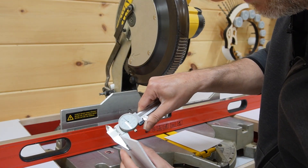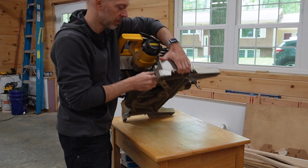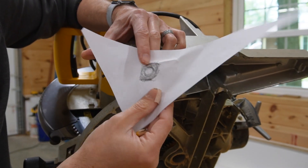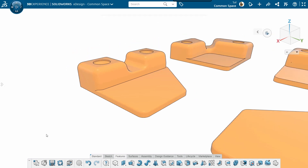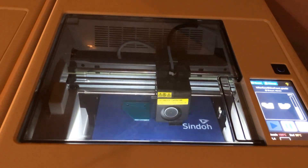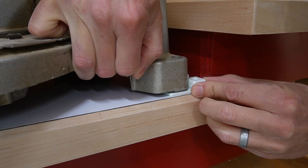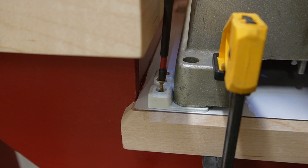We can take this now and use a set of calipers to dial in the exact amount. With the thickness measurement in hand, I want to also measure the feet on the miter saw, so I tilt it up on its side and rub a pencil across the foot to transfer its shape to a piece of paper. Then I jump into XDesign to model a few shims. I want my shims to also act as stop blocks that help me perfectly position the saw anytime I need to remove and replace it. So I take a few minutes to model two front and two rear shims, and then print them out. I only have green filament on hand, so I quickly spray the pieces with white paint. Once dry, I place the shims in each corner, making sure they fit snugly, and then hold everything in place with a few clamps and screws.